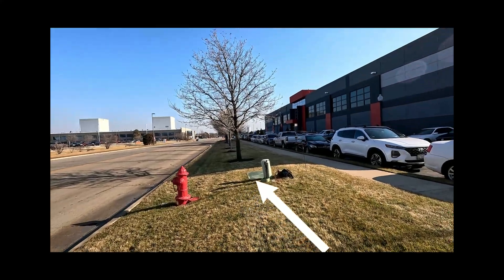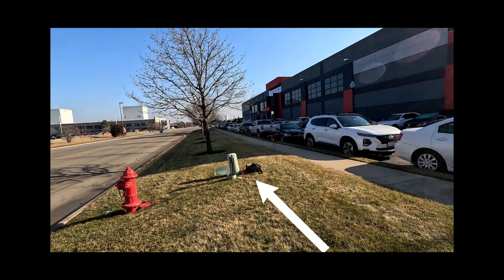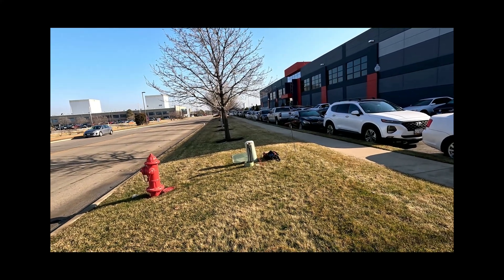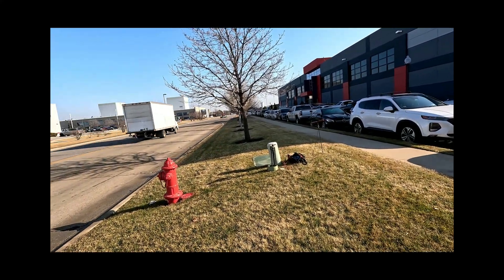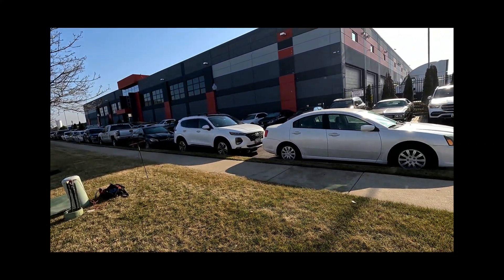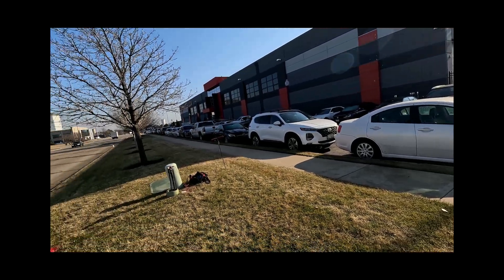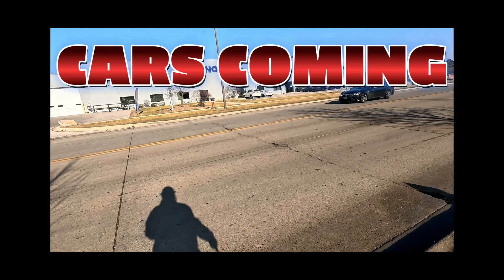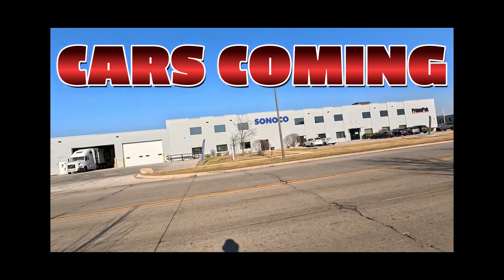Right here I'm going to do a 360 sweep to catch the third line. I know the other line just goes east, and the third line should go to this building here — per the prints. But we always do a 360 sweep to verify it's going to that building, because sometimes it might just go into that building.